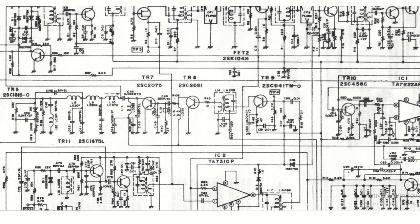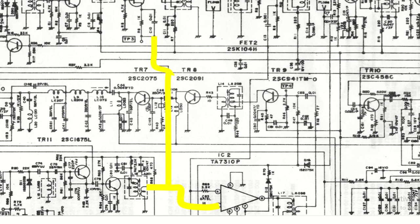These stages are sets of FETs and IF transformers calibrated with capacitors and adjusted to only pass part of the signal, or an intermediate frequency. A frequency from the VCO that is 455 kHz lower than the output of the VCO used for transmit is needed for receive. This is why there are two offsets in the variable section of the VFO source code.